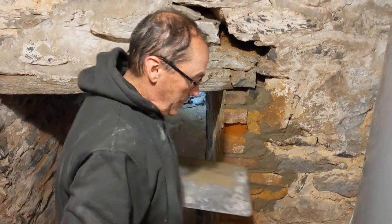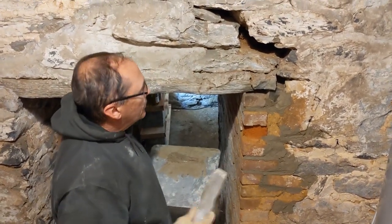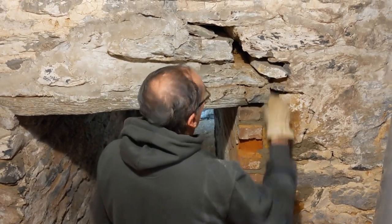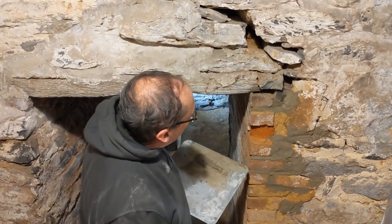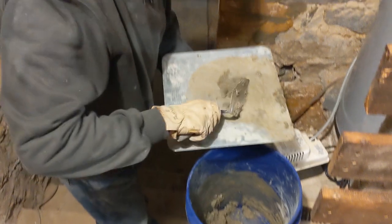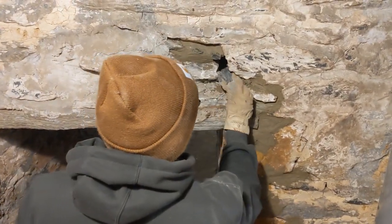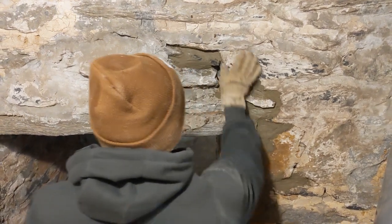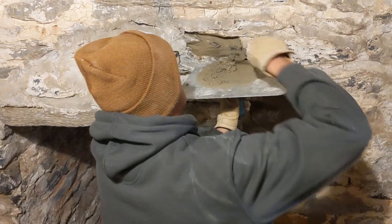This is going to be interesting getting enough mortar in there to refill. Fortunately you can't just gum it all up with more mortar — you're not supposed to. Mortar is supposed to hold things together. We have a stone here which I think was part of this wall. I'm going to put that in there along with a couple of other stones. I'm going to finish patching this up, then make another load of mortar. I already put some mortar deep into the wall to add strength and now I need to do the finish work — adding the stones and doing the finish mortar around the front. Probably to an experienced mason it's painful to watch, but in the end I think it came out pretty good and the wall is definitely going to be stronger.